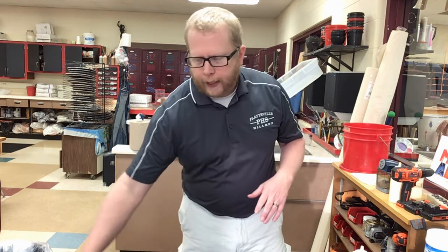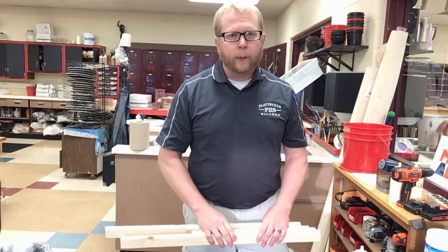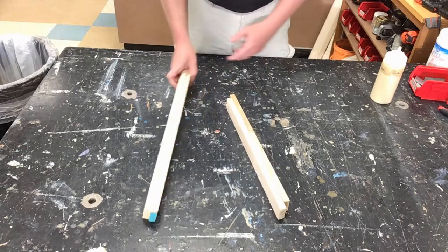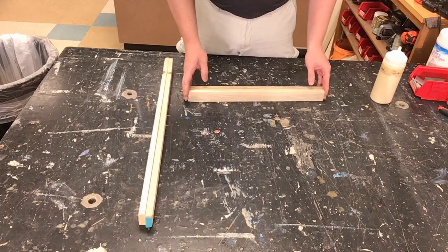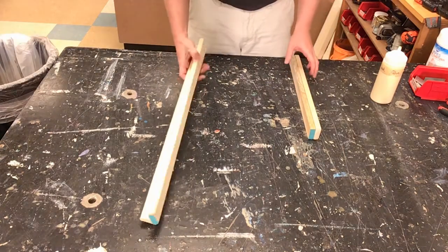The depth of it is 28 inches. So it'll stick out a little bit beyond inside your cubby, but it kind of is what it is. So I already have that all cut right here. I'm going to angle the camera down so you can see how it's constructed. Here are my two boards. These are 18 inches wide and 28 inches in length.